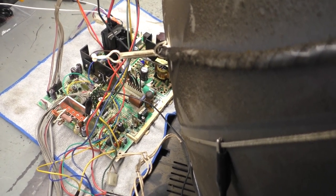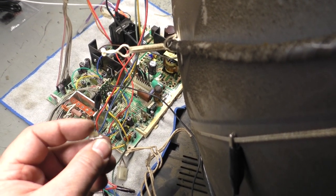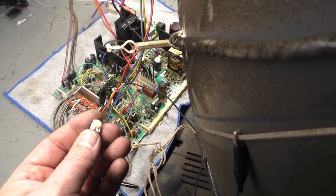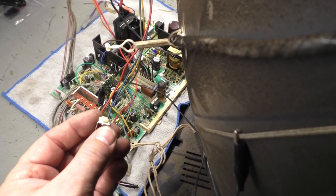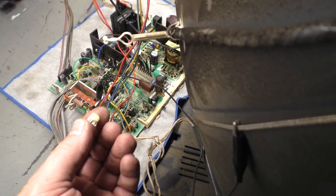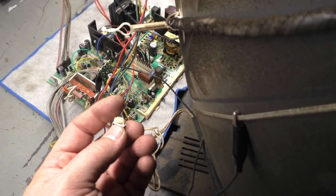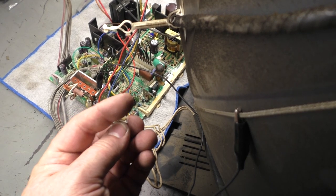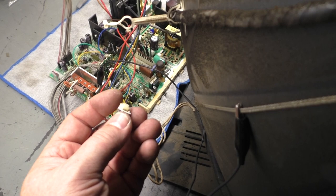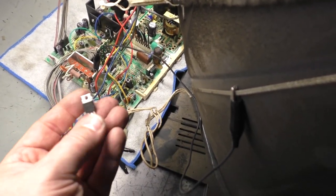Great. And it turns out that the B-plus pot is faulty. The cap on here that you adjust is loose as hell, and for a very small, momentary time, the pot became disconnected from the circuit because the pad that rolls around on this pot when you move the head came off of the bottom part that transmits the resistance through the chassis. When that happened, it shorted Q101.